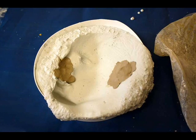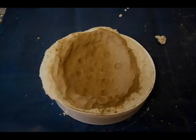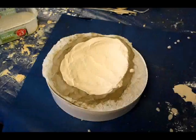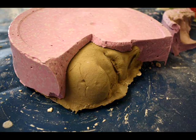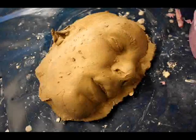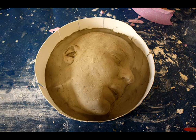The clay press simply involves pressing a very soft clay into the Alginate to make an impression. We used wed clay, which is a very soft water-based clay often used in movie prop sculpting. We pushed clay into all of the details over the surface of the mould, starting with small pieces and working our way up until it was all covered. Then we backed this with plaster to give it a rigid base. After about half an hour when the plaster had gone off, we flipped it over and broke away the Alginate. This left a piece of clay exactly the same shape as my face. There are some bubbles and creases where the clay didn't get pushed in properly, but because it's clay you can re-sculpt and fix any problems — or even sculpt in character details like rotten flesh for a zombie.